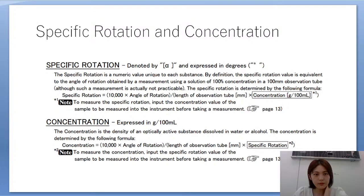REPO5 measures angle of rotation and refractive index directly, but to know specific rotation you need to know the concentration beforehand, and vice versa. This is because specific rotation equals 10,000 times the angle of rotation, divided by the observation tube length in millimeters times the concentration. So you must know one to calculate the other.